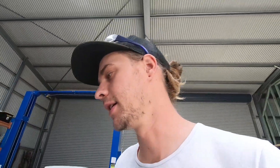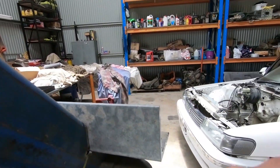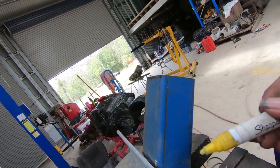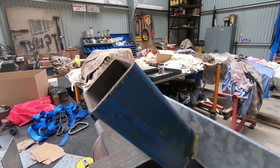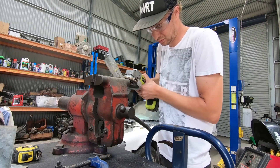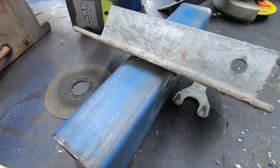As a lot of you probably know, galvanized steel is a real pain to weld — you saw it in the last episode. You've really got to clean up all the galvanized coating because it just doesn't work otherwise. I've put the angle in center and I'm marking where I'm going to weld so I know where to clean up — you don't want to spend all day cleaning areas you don't need to. I'll clean it up on the bench grinder or with a flappy wheel on the angle grinder, and clean the paint off the black steel too.